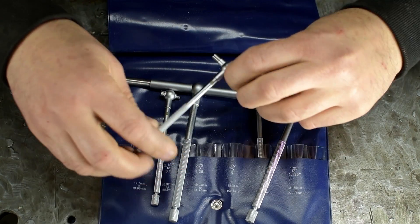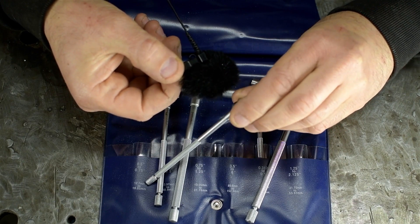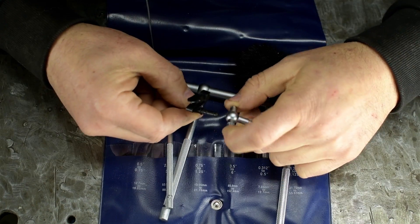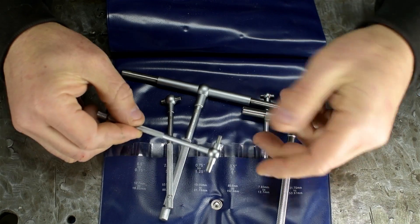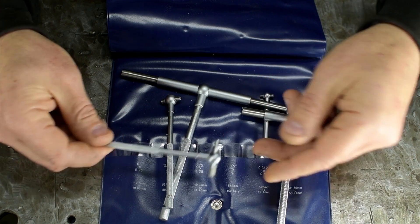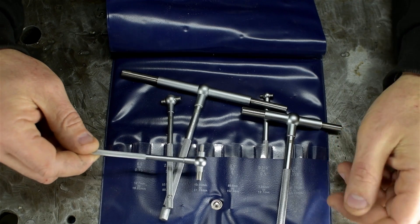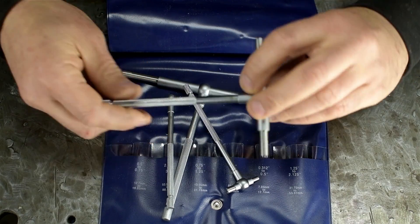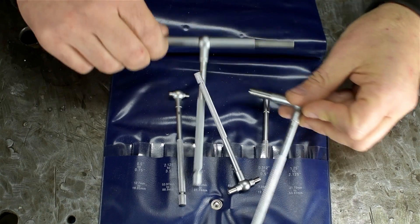Almost all of them are crunchy. They're not silky smooth. The lock seems to work well enough, but now my frustrations have flipped end for end. I'd always reach for these when I needed bore gauges — I mean, they're my Brown & Sharps — but I'd try to take two measurements and just pull out the old set. I've decided to do something about them. I think the underlying problem is they're just poorly deburred.